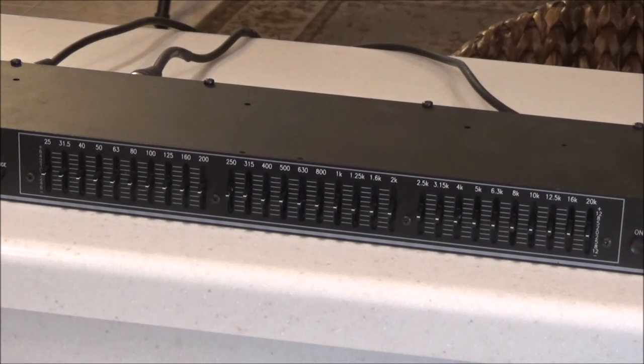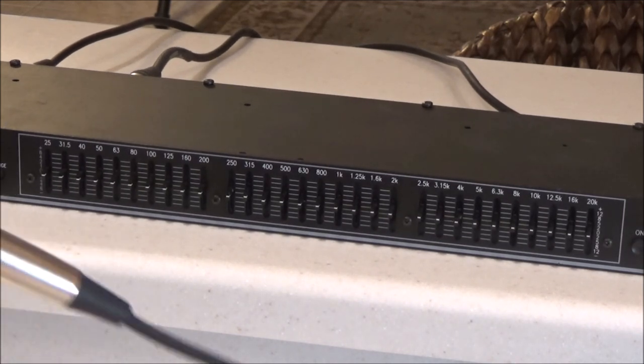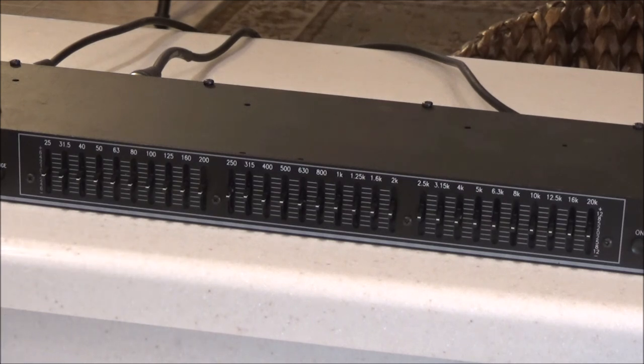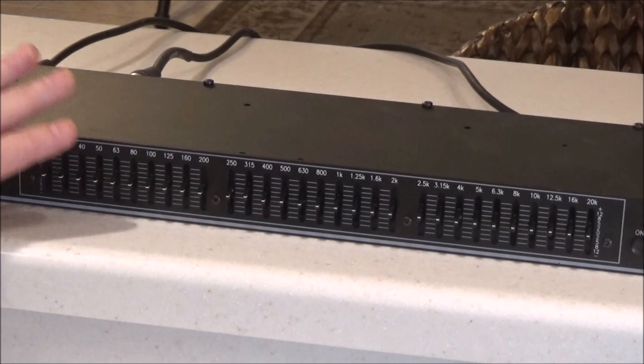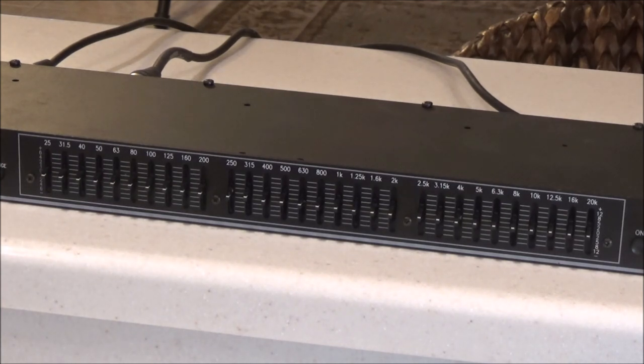You should actually adjust it so that when you hit the bypass on the EQ and talk into the mic, it makes zero difference in level with or without the EQ engaged. So after cutting the frequencies, we might need to turn the level of the EQ up in order to make it as loud as it was before we cut the frequencies. Nothing here is meant to make anything louder. You make those adjustments at your crossover, on your power amps, or on the general master on your mixing board.